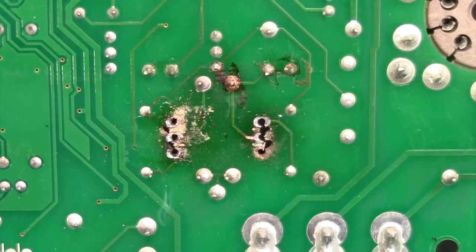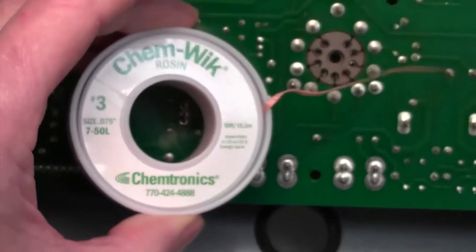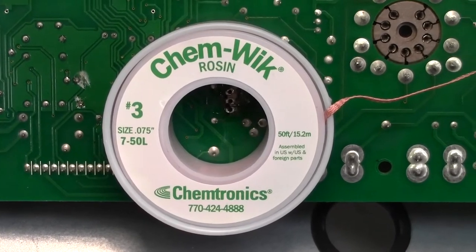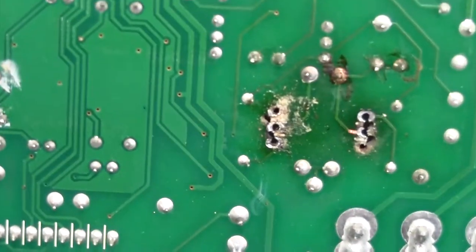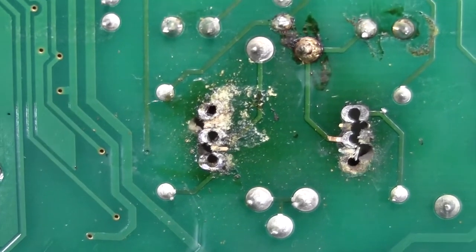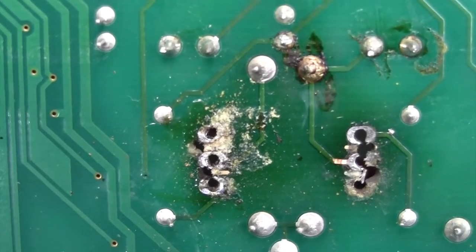That was pretty hard actually — my de-soldering tool wouldn't touch those pins, the solder just stayed on there. I had to resort to using some Chemwick de-soldering braid. Very good stuff this — don't buy cheap versions, get the expensive version. By putting a soldering iron onto it, it sucks up the solder along the braid, and I was able to clean these up. I haven't used any solvent yet, but just have a look at the mess that this is — that's going to take a little bit to put back together neatly.